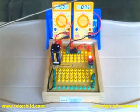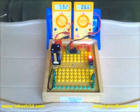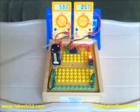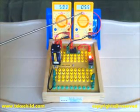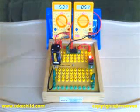The current drops, so the LED glow also reduces. The thermistor is cooling and the current will come back to the original value in a few minutes because it has to cool down. Thank you for watching this movie.